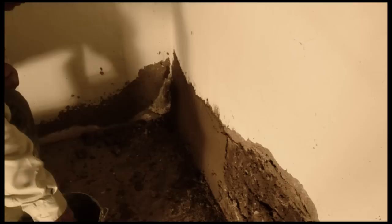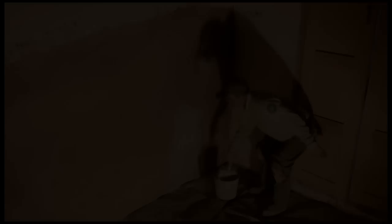Here, getting ready to use the wooden trowel — he's going to soak it in. You want to have it soaked and then just go in rounds. You kind of want to overlap what you plastered so you can blend in the old plaster with the new plaster. The running mix used for the third coat is applied with a brush.